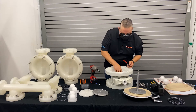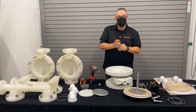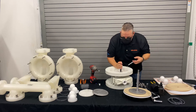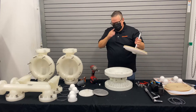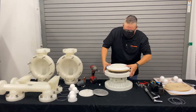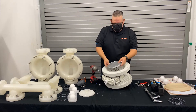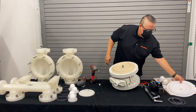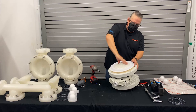One of the biggest problems is that if the snap ring is not properly installed into the snap ring groove, it can come off during the first or second stroke of the pump. Now we'll continue on to the diaphragm assembly. We'll put the diaphragm through side A, flip it over, then put the inner piston, the backup diaphragm, the primary diaphragm, and the outer piston together.